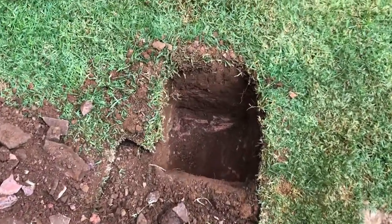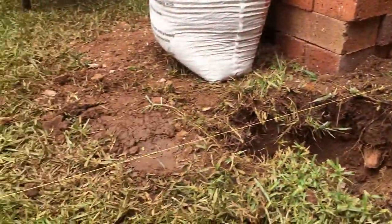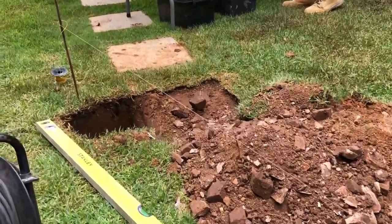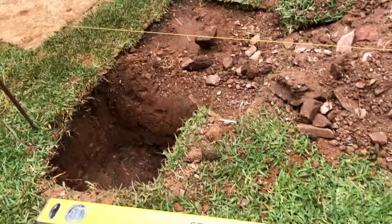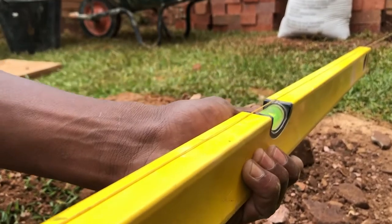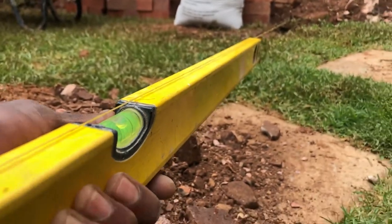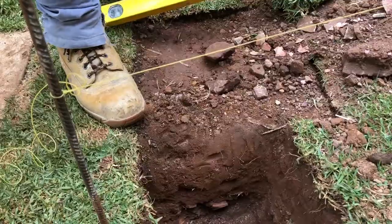As in part one, we got stuck in with the concrete foundation. These are the footings that we've dug out for the four wooden posts that will be going into the ground. But we're going to be placing a metal post bracket into the ground first — and I'm surprised we did not find any diamonds here with the amount of rocks that came out of these holes. Now here we're determining the elevation of our metal post bracket using a string line and a spirit level. We place the string line on the top end where the post bracket will stop, then level out the string line, giving us the top height of our metal post bracket, which came to roughly 65 centimeters, which is about 25 inches.